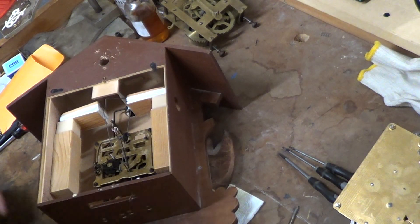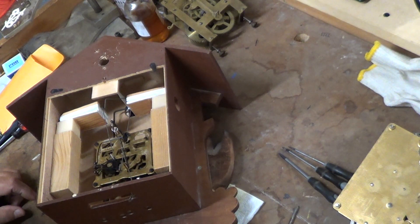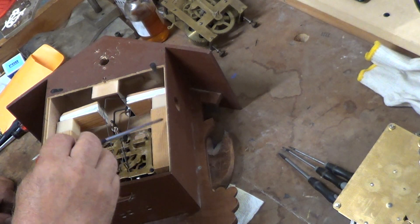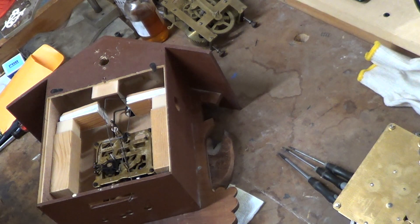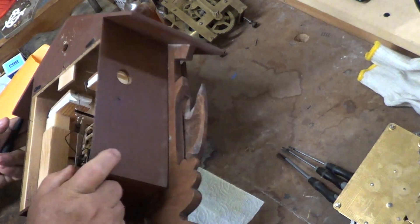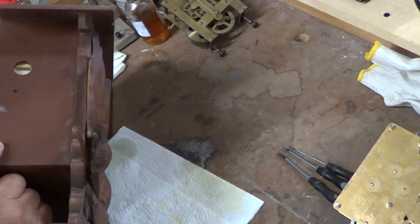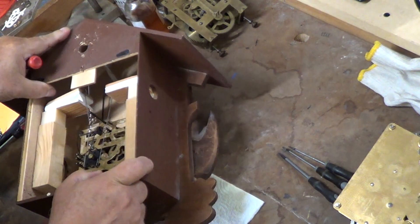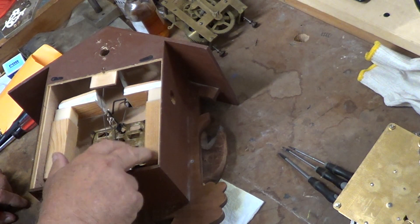The next step is that the bellows have to come out. On some of the newer clocks, these bellows are glued in back here — they have a little dab of glue here and right there. When you look at these, there's going to be a screw on the outside, and then they're going to have a nail or a little staple. This is the newer version because it's got a staple rather than a little nail. That holds it from the screw and keeps the bellow from sliding back and forth inside the case.